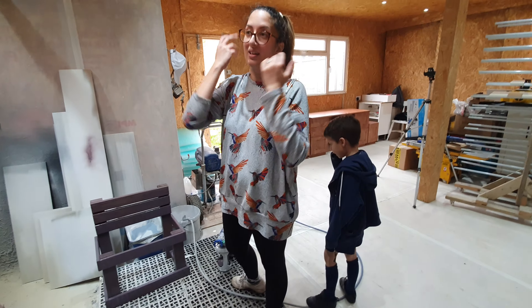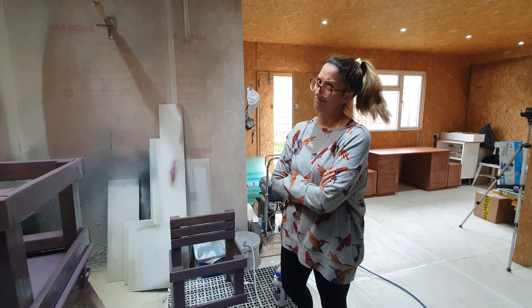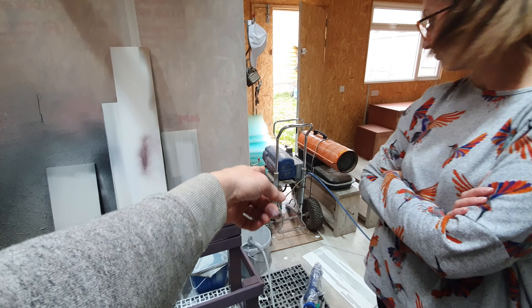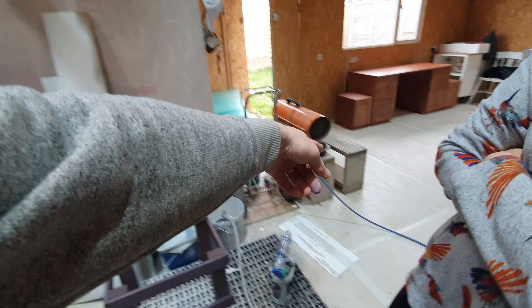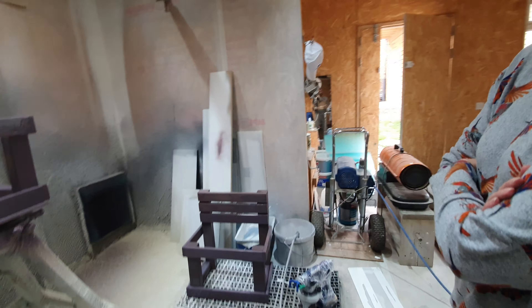It was unscripted - we're not scripting this one, just off the cuff. Overall it seems pretty good - I like it. Worth the money, 500 quid. Well, if it works and helps you on site for touch-ups, it's perfect. Imagine putting that in the big machine - it would suck up one litre of paint before you even start. It's so much better than the big one because I'd have to clean out all the pipes - wash that out two or three times, that's an hour's worth of cleaning. This is three or four minutes. You can replace the pumps on these brand new guns - 200 quid and it's a brand new pump, back to new again. They do about 250 litres I believe.